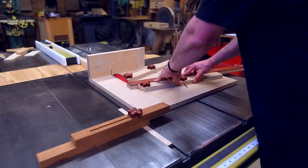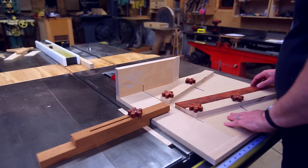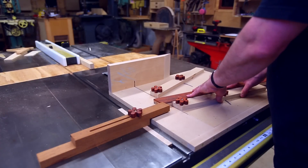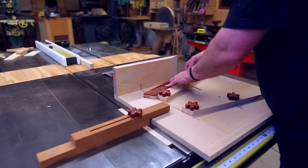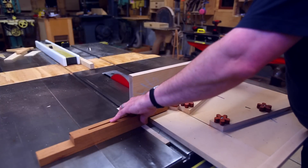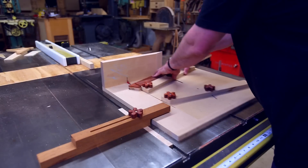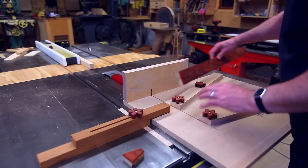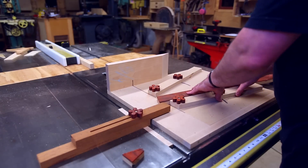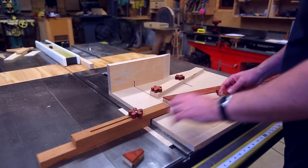You can see I can cut one angle, and using the same fence I just get a parallel cut. But if I move the piece to the other fence, I get a segment with the angle that's the difference between the two fences, and it brings the segment back behind the blade. I can pick the segment up with the blade behind the big front wall of the sled. This setup is safer — when you're doing thousands of little segments, it just takes one lapse in concentration and you touch the blade with your finger.